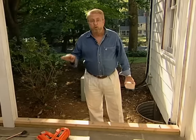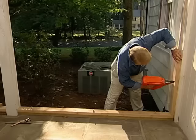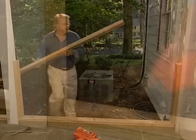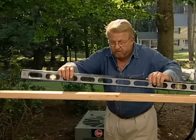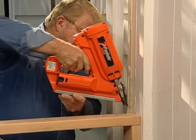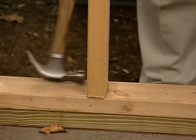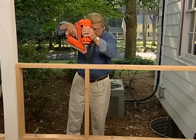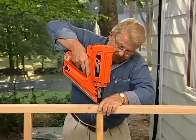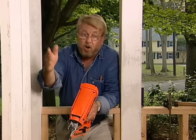My double base plate is now securely fastened to the deck. Now I'm going to build a short wall here complete with a top plate and studs about every 16 inches. The end studs are nailed to the posts, then the top plate or sill is set in place — I check for level, then nail it down. Next I install studs every 16 inches or so, making sure they're plumb vertical, then end-nail at the top and toenail at the bottom. That finishes this side of the porch — soon to be a room — and now I'm going to do the same thing on the other walls.